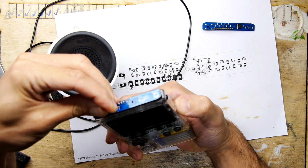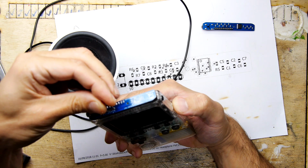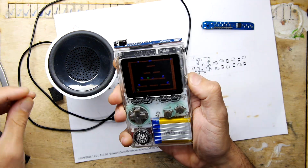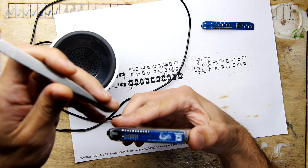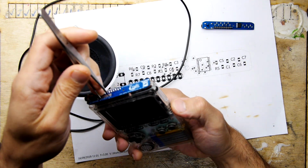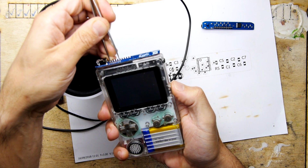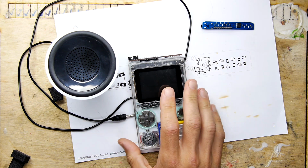Interestingly enough, look at the LED, it did flicker there briefly. Sometimes what I noticed was you can use the LED almost as an access light, because if you have the LED on, I'm not getting anything on that one. Let's see what happens if you totally short the 3v3 out. But I'll have to experiment with that. I certainly got some loads here and I was putting them on ever increasing loads. Okay, so if you short out 3v3, it's totally dead. You don't want to do that. Let's have a look.